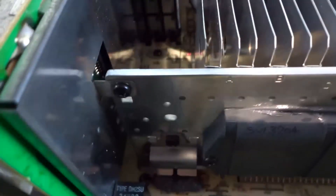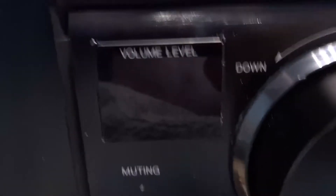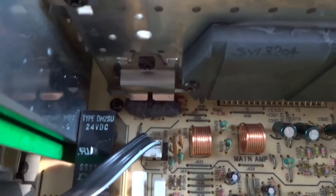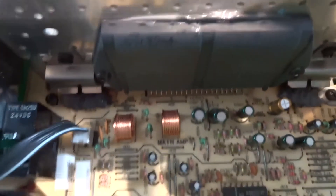I suggest doing that modification because they do get hot these. The fan normally only kicks in when it's really loud, and I don't really play it that loud — it doesn't need to be that loud on the speakers I've got in the living room because it sounds amazing. So there you go — it's an intermittent solder problem. In the next video I'll be taking this all apart, stripping it down and getting that reflowed. I think it's probably one or two connections on those two transistors there. See you in the next video, thanks for watching.